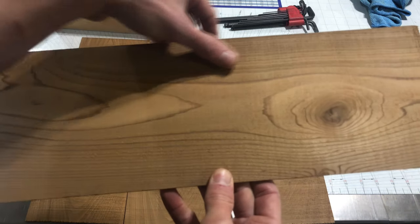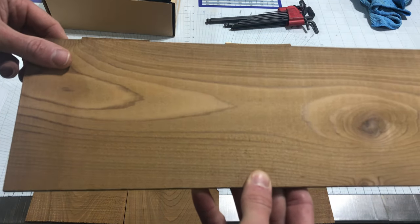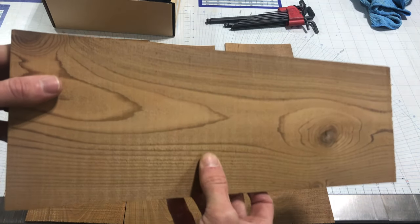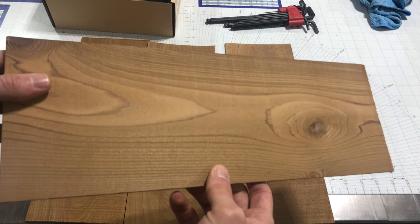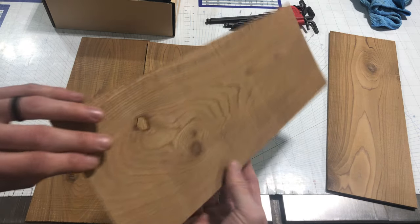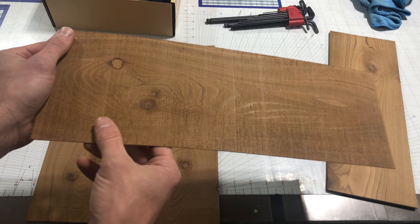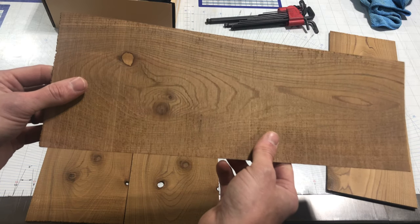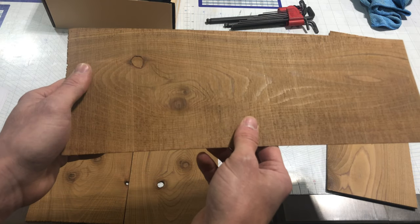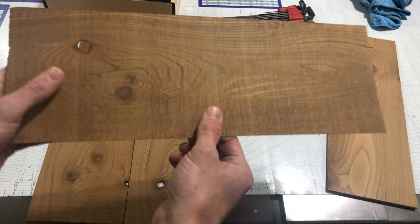We've got some saw marks left behind. This was actually the piece I pushed a little bit faster, and it did a pretty good job. Now this is softwood, so I don't know what it would do on a hardwood, but not bad. A lot of re-sawing has to do with your feed rate. This thinner one we pushed fairly slowly and we've got a fair amount of marks. When you want to do a really thin veneer, I'd recommend cutting it a little bit thicker and then running it through a drum sander to even it up, since you're probably doing a glue-up and want that surface as consistent and smooth as possible.